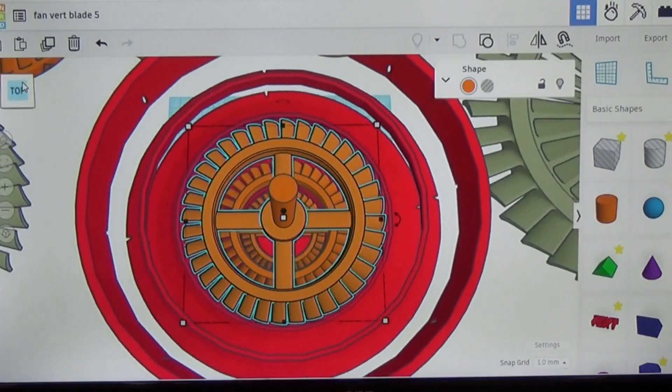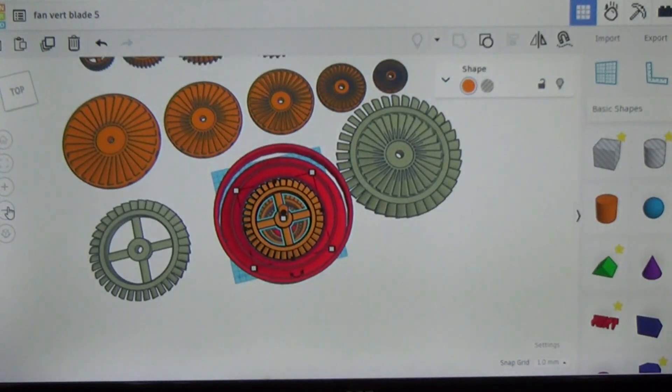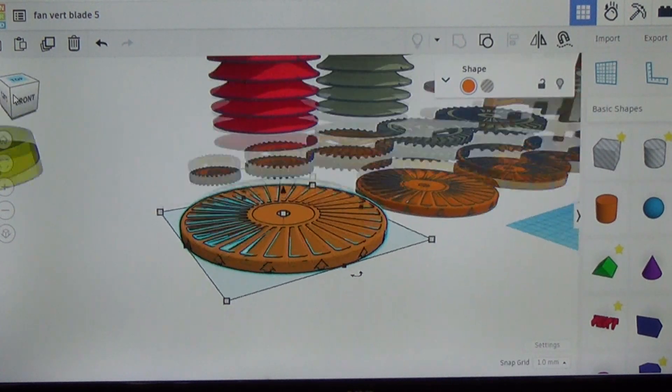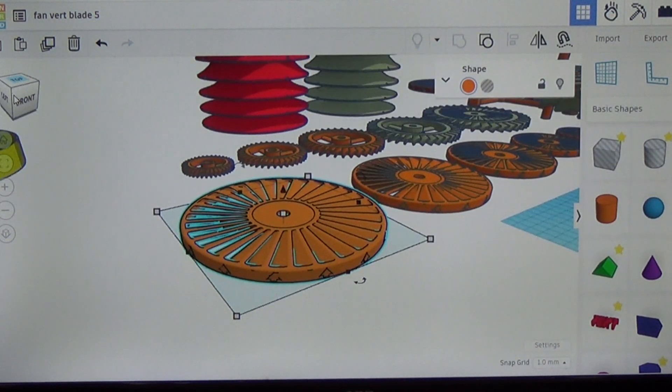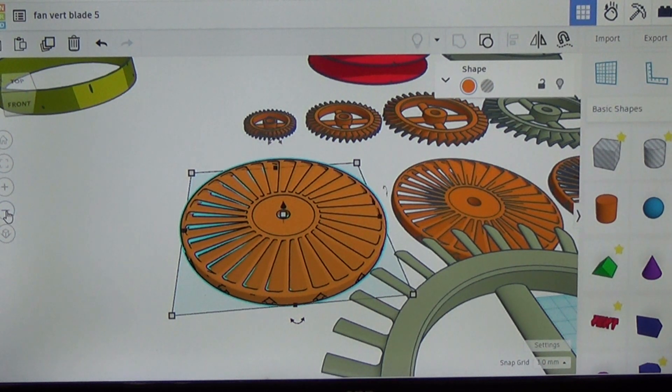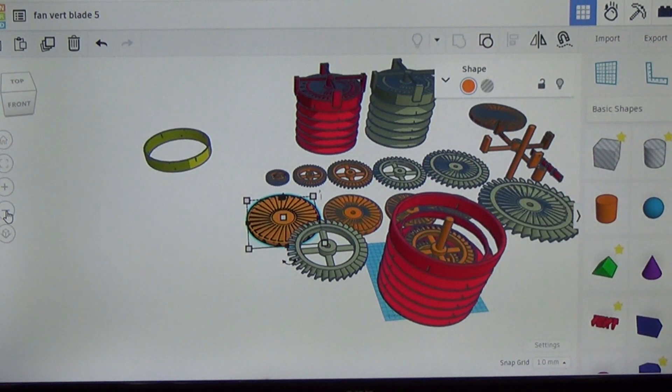I think this design is going to work really well. I also modified it slightly to see if we can make it even better — that's a full fan blade design that stacks exactly the same way as the other blades, with openings going down through each one. We're going to test both new designs and compare them against the original single-rotor design within the confinement ring — testing which works better in high-speed winds and which works better in low-speed winds.